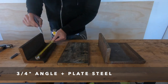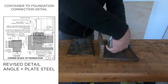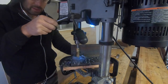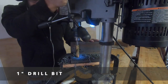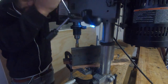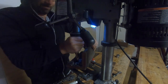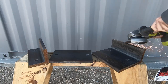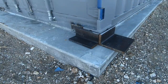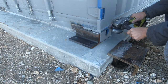Structurally we were required to anchor the containers to the concrete slab foundations. We looked at several options before electing to use a combination of heavy duty angle steel, steel plates, and threaded rod. One of the main reasons to secure the containers to the slab is to prevent movement during an earthquake that could shear the plumbing and electric connections. I measured the locations for the holes and then used my drill press to drill one-inch diameter holes in the steel. These sections are three-quarters of an inch thick and it took a while — we went through about three different drill bits to do all 72 holes. These heavy pieces of steel will be welded to the corner blocks on the containers and then threaded rod will be inserted in the holes and into the concrete where anchoring epoxy will secure them. I ground away a bit of paint and rust to prepare the pieces for welding.